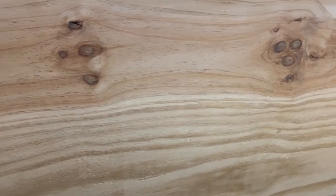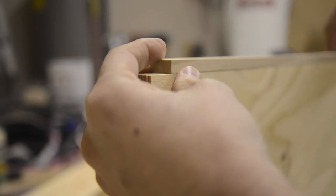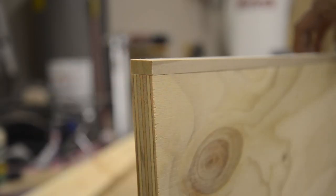There are also plywoods in the middle area that aren't too expensive but still look pretty nice. One of those is radiata pine — it's about 60% the price of a sheet of oak plywood, so quite a bit less expensive, but it looks way better than OSB. You can actually make a pretty nice finished project if you pick through the pile and get a nice sheet, though most of the time the other side will be rough with knots and a construction look, so you'll often need to hide that side. One big consideration, especially with MDF and to a lesser degree plywood, is that they don't like water at all. Plywood can be weather resistant as long as you keep water out of the ends where the layers are exposed — most of the time you'd put solid wood banding around the edges and then apply a finish to resist water.